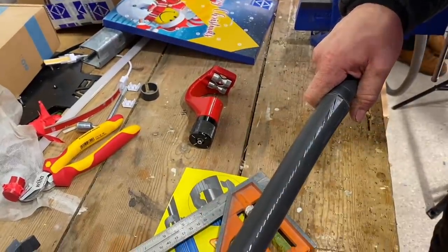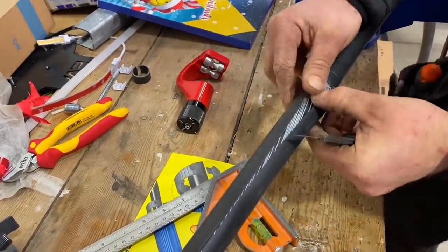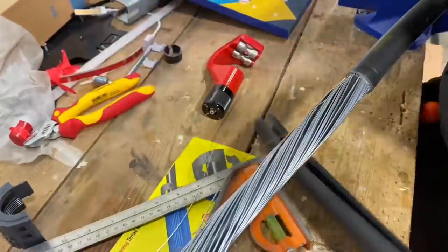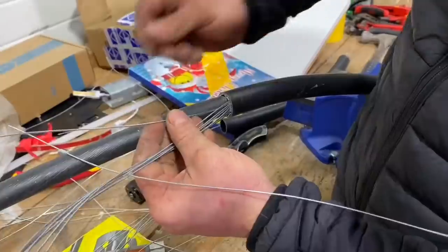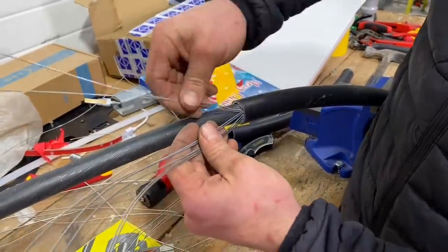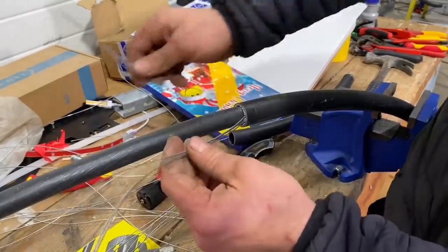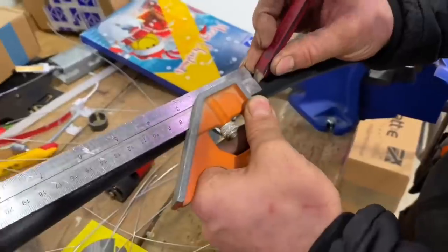He's using a knife to remove the outer PVC - he could have just run down the cable by turning the tool the other way, but old habits die hard. One or two wires have broke off, which suggests we've got it in nice and deep. Being his first time with the tool, he's still learning how many rotations and how much tightening to do, but it looks pretty good - the wires are breaking off nicely and easily. People may have also noticed the advent calendar in the background, which timestamps our video to towards the back end of last year.